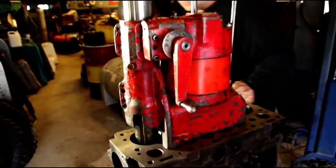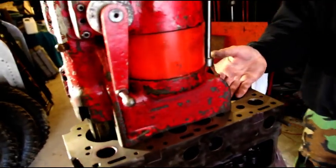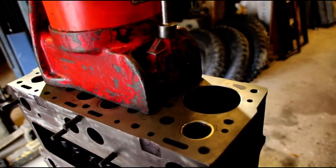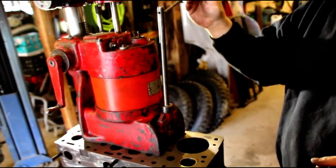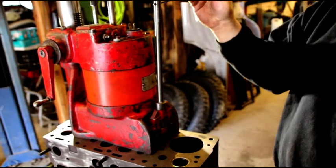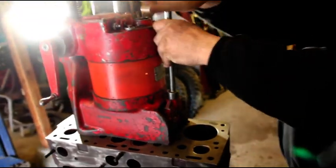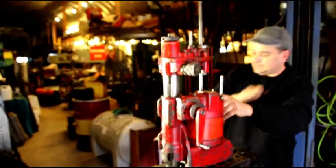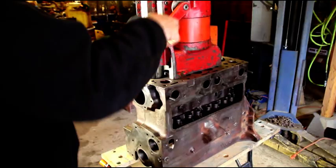To anchor this to the setup, we keep our cat's paws out. We've got that piece underneath the block grabbing on each side of the cylinder wall, a little bridge and a little clamp plate. We're just going to tighten this right now — that's pulling up on our clamp in the cylinder hole. It's going to make a rigid setup, and the boring bar won't move once we have this nice and tight. We know that's centered because the cat's paws are out.